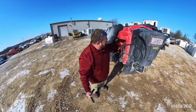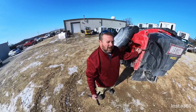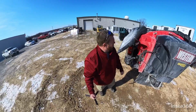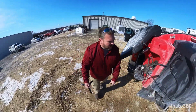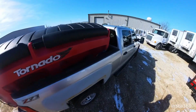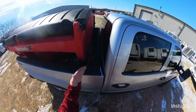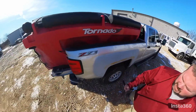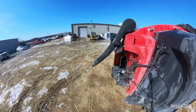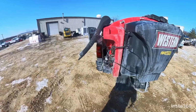The more you open this gate, the more salt is going to lump over each time, and we've noticed a lot of times we're getting salt feed back under it. And I'll show you here. We'll go to the other side. Up under the spreader down here, as you can see, it's returning salt back up under here and piling it up. So we think that's from running the gate too far open and the material flow too slow. So we want to kind of avoid that. So we normally run them on about 3.